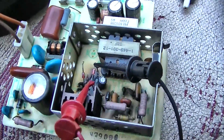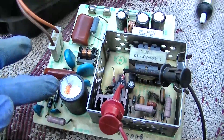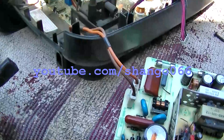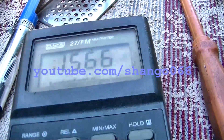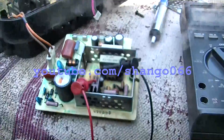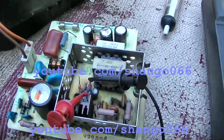It should not be burning these diodes up — I don't understand what's going on with that. There's really nothing that can cause that. It comes in, it's filtered to DC, and then there's a dropping resistor here and those go to ground. So unless he's got extremely high voltage where he lives... I don't think that looks right. That capacitor just clink-o-twerculated. Good thing I had glasses on.